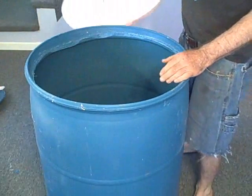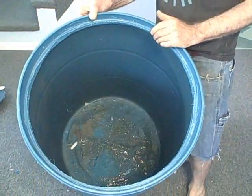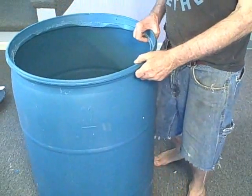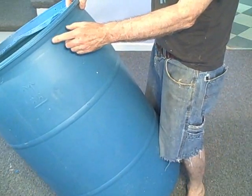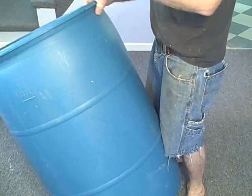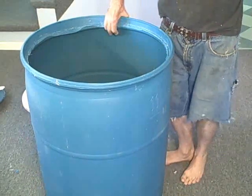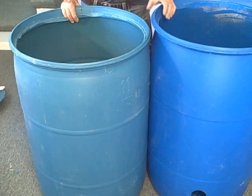We're still not done with this tank. We're going to be installing a tube, either PEX or polyethylene, inside the tank. The last thing that you'll do is have exit holes for your polyethylene or PEX tubes, and I would recommend doing that through the side of the tank near the top. Before we do that, we're going to have to connect these tanks. This is designed for a multi-tank heat storage system.